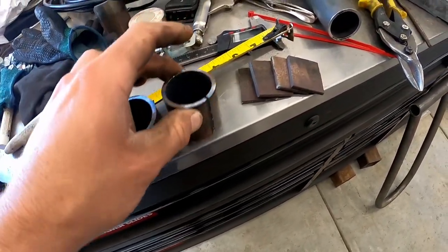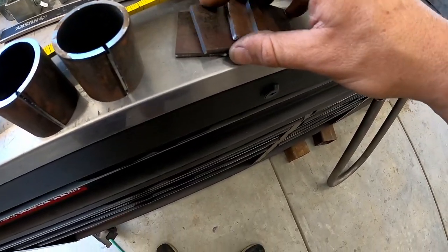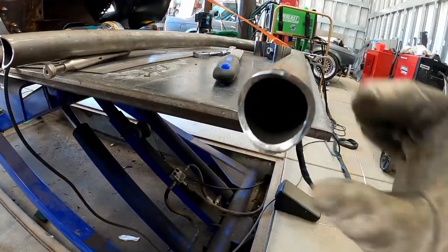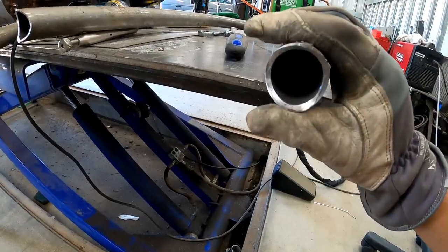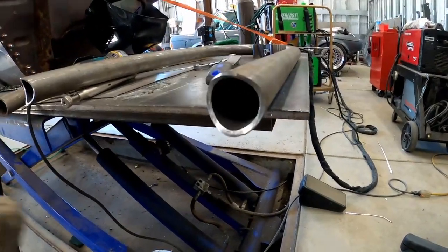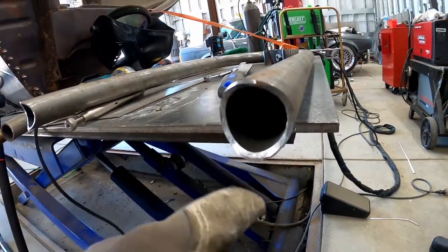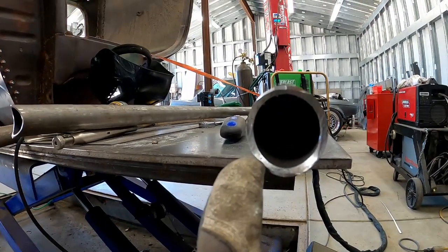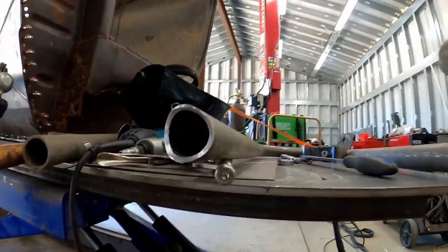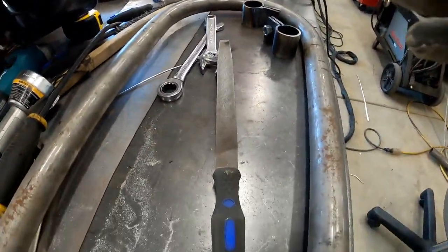Here are our upper and lower clamps — marking where we're going to put the bolts through, just got to drill some holes and get it welded up. One of my subscribers was asking if I do anything with the edges after notching with the tube notcher — I do. You can see how it's coped all the way out to the edge, and these areas that come to a point we're going to knock down flat. I just take a little file and grind it out.